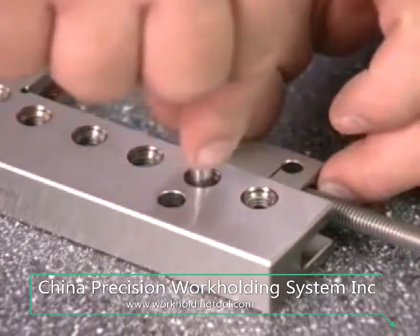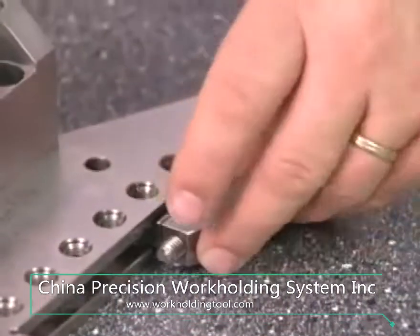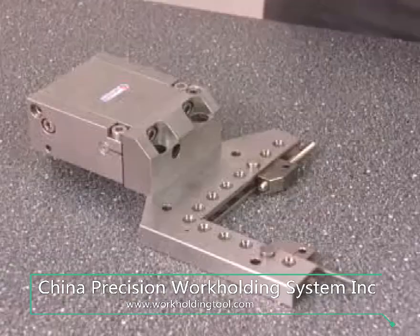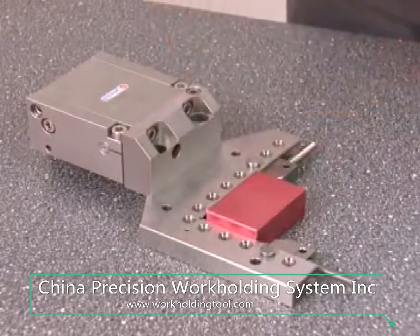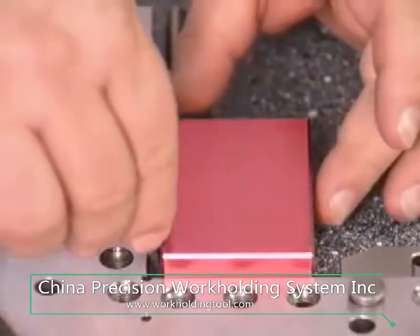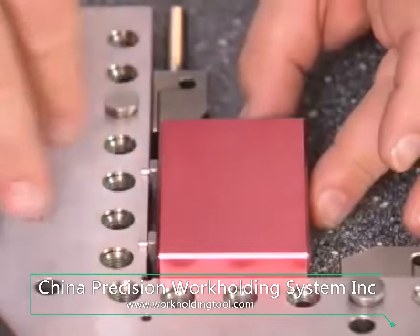The angular univise mounting bracket also includes two clamping jaws to fix workpieces laterally. These spacer plates provide the necessary space to ensure that the EDM wire can be threaded in any position.